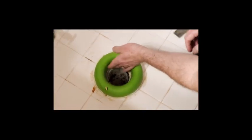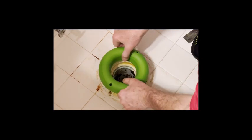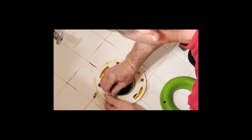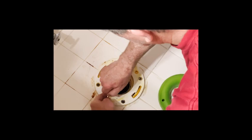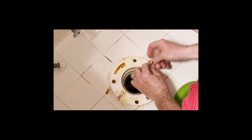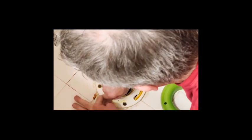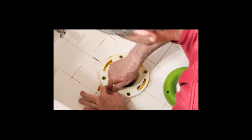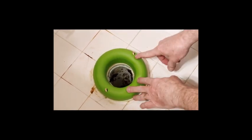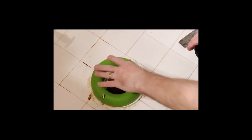The sani seal has holes so you can position the bolts perfectly and line everything up. Put the plastic anchor captures on first to hold the bolts in place so they don't fall into the drain. Now set the sani seal over the flange. It doesn't look very high right now, but once we set the toilet on it, it'll compress down. We'll bring the bowl in and dry-fit it to check the bolt height before committing.